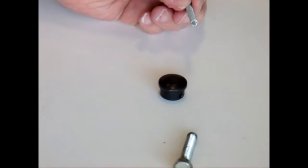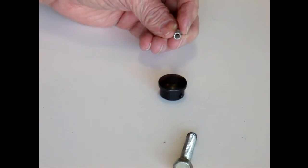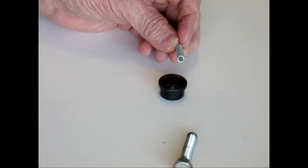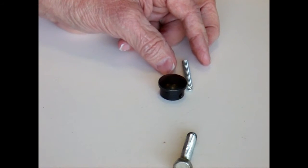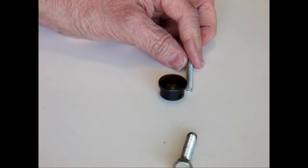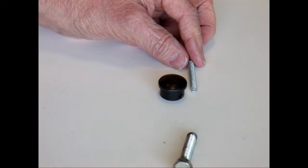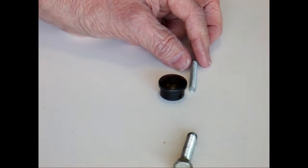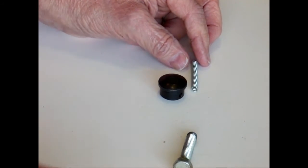This will result in the valve being opened faster and for a longer time, which will allow more CO2 into the breech, and it will drive the pellet out the barrel at a higher foot per second. But it will also use more CO2 gas from the CO2 cartridge.